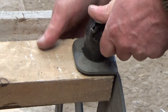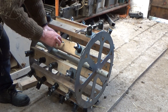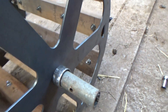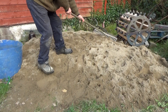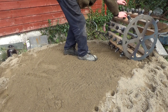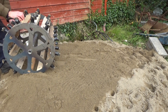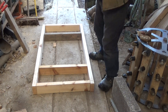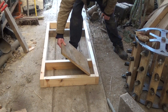The contraption needs 48 of these spikes, and bolting them on took a little while. In hindsight, I should have used coach bolts. I then tried them out on the sandpit and was relieved to see it did seem to work. Of course, this is just soft sand — our stony, hard soil will be much less easy to press into. In theory, if the dibber drum weighs enough it will sink into any soil, but in practice if I make it too heavy we won't be able to move it at all, and it might buckle under its own weight and keel over sideways. I'm guessing some extra weight will be needed though.